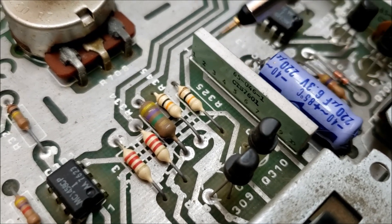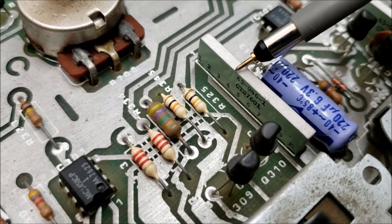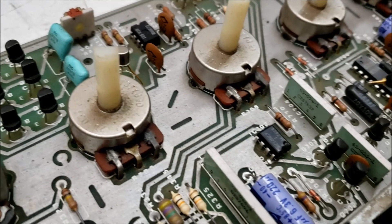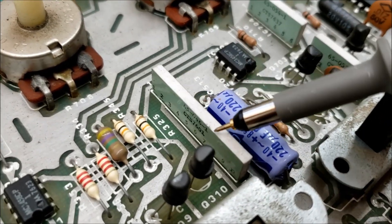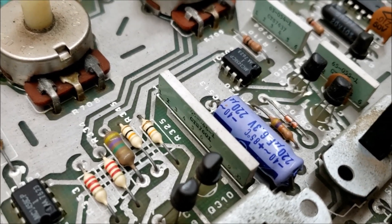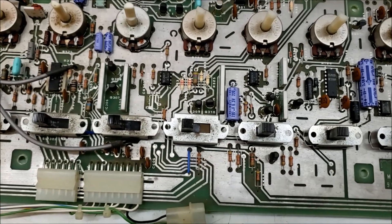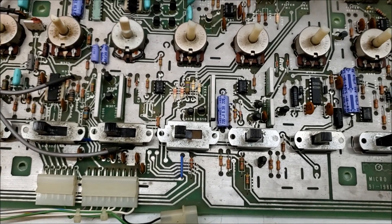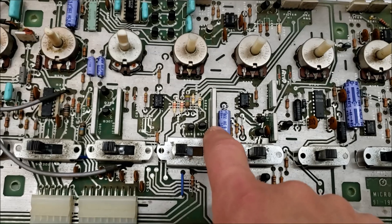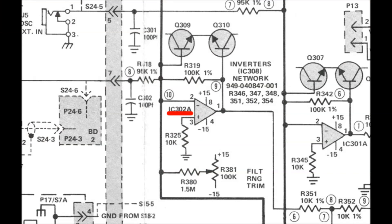The wiper of this pot is connected to this custom resistor array. We know these CTS resistor arrays to have a pretty high failure rate from the ARP Omni — they're very easily damaged. This is a custom one with precise resistance values, non-standard one-percent tolerance type values going to each of the pins. So let's check that out and make sure this resistor array is okay. I took a few in-circuit measurements of the resistor network and it seemed to be okay — I could see the cutoff frequency value changing as I tweaked the pot. So the most likely suspect then was this op amp here, IC302, which sums the filter control voltages.